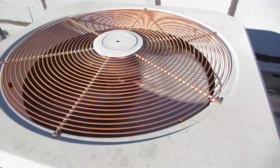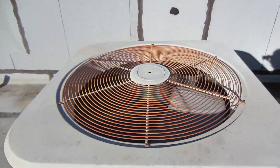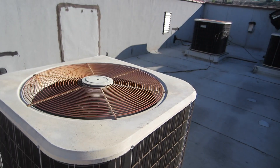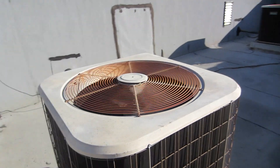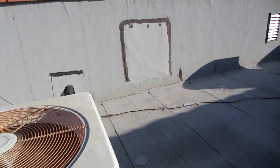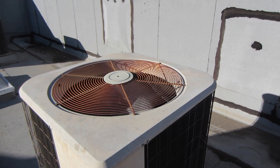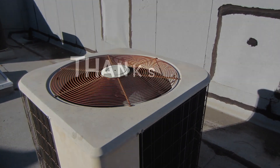So that is the mild weather switch for a heat pump — works great when you're mismatched. Protects the compressor and you don't have to adjust the charge every season. Just throw in a mild weather switch.